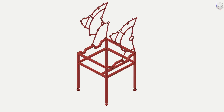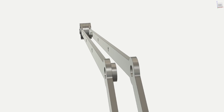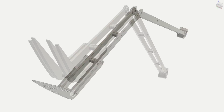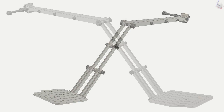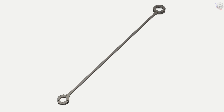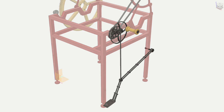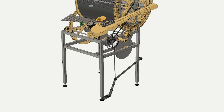When I had my results I could start to CAD the actual part. Since I'm used to working with plywood I have to be very careful not to oversize stuff when I design in steel. I'm using 4mm thick steel sheets that are going to be water cut. For all these moving parts it's really important that they are stiff enough and hold up for the force of my entire body pedaling, but it's also really important that they don't weigh too much. It's really a design compromise between light weight and durability.